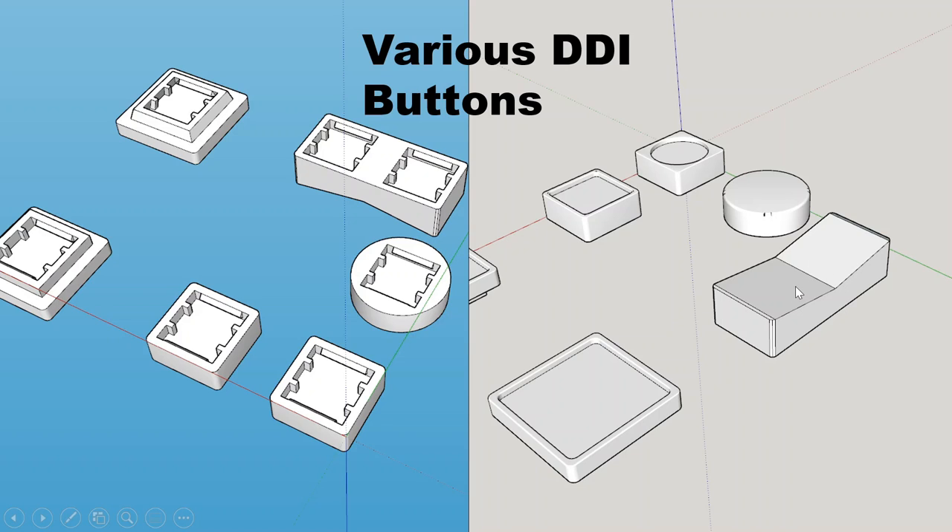The 6x6mm micro switch has a very good tactile feel and clicking sound. The larger 12x12mm switch is actually not as good as a keyboard key, but it doesn't fit in the very thin bezel of the central moving map display. You cannot fit a larger switch without changing the overall form factor and true sizing of the display itself.